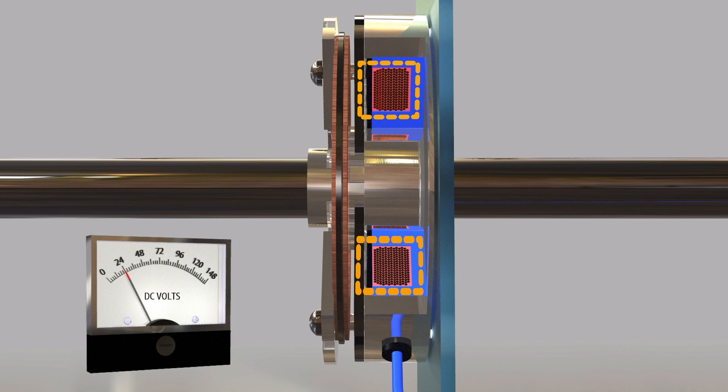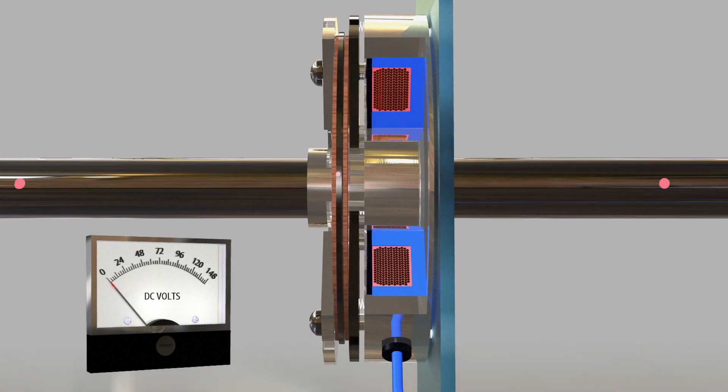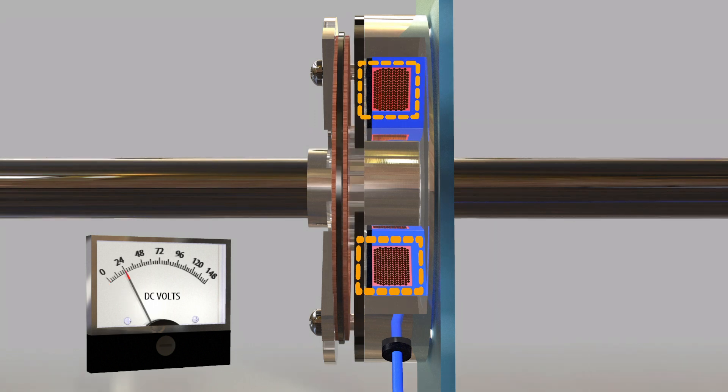The difference between the two is that during dynamic stopping, heat is generated, so the brake and friction material have to be sized to handle the energy during braking. With a holding-only application, only the static torque needs to be considered.